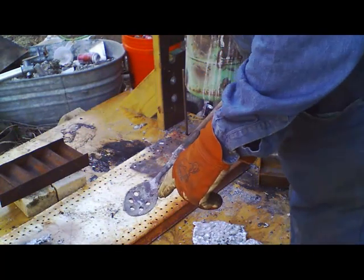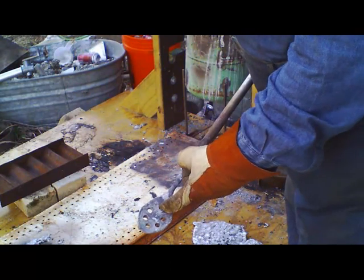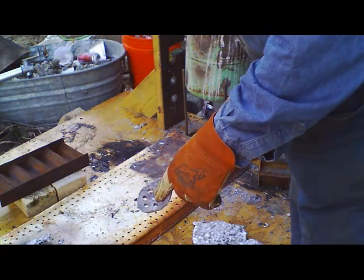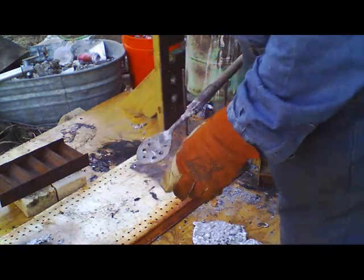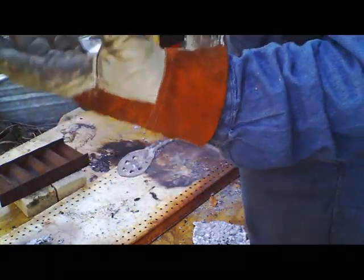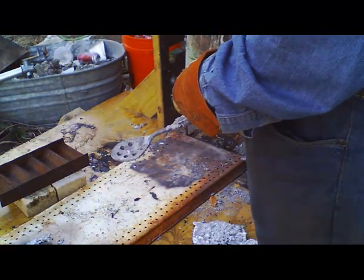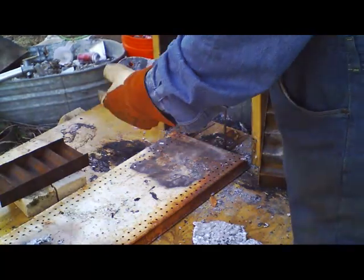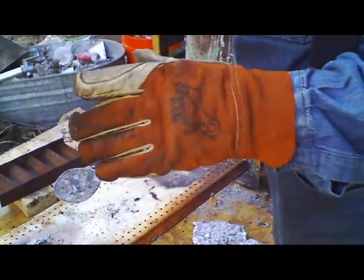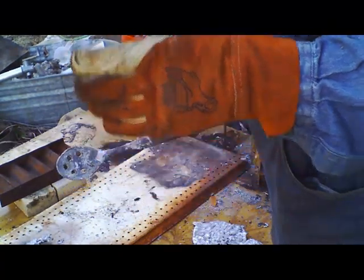Back to the spoon — I did have slots in here, but they weren't wide enough. I'll have to recut them. You want holes in it to let the aluminum flow through, but the slag is so bulky, so thick and heavy, that it'll catch the slag. And you are going to have a lot of slag if you're using just soda cans — believe me, you've got probably 60% slag from soda cans.